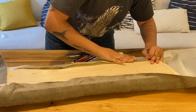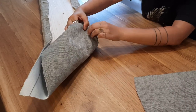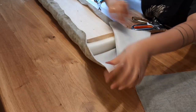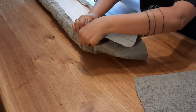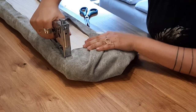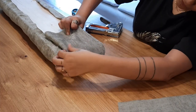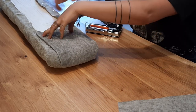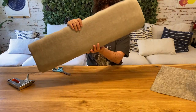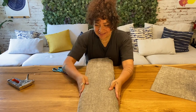At the top we have to be a bit more careful because we want a rounded effect. Unlike the bottom, we're not going to just pull straight over — instead we do it from the corner, making little pinches on the side and then folding a little triangle at the corner. The middle section becomes one big flap to cover the top. Again, pull it tight so the top becomes round. Remember we gave the material three extra centimeters on top, so it folds nicely over the wood. I was absolutely shocked that it actually worked out.